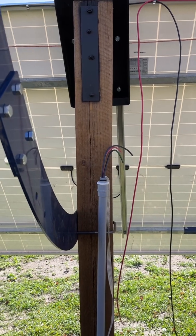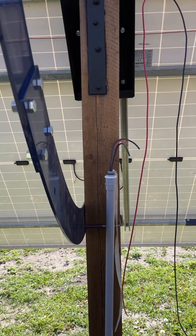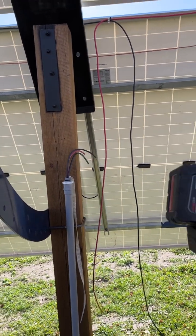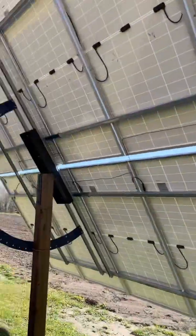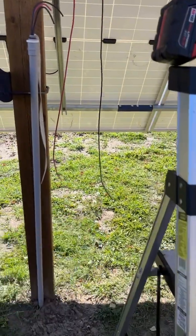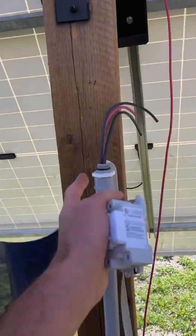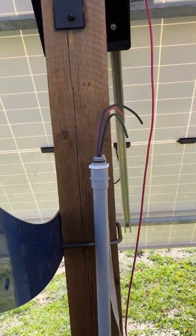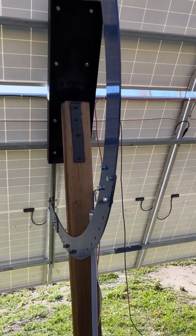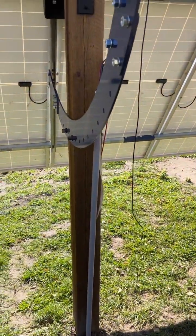I bought the IMOs not knowing, and I'm only running a six-by-six array so I didn't want a big metal box. I've chatted enough. Last one to do: positives disconnected, negative extension wires disconnected — no current coming in. I'm still going to check both wires because it's the right thing to do. These run back to the charge controller where everything is disconnected. I hope that helps some of you folks looking at this type of wiring or these switches specifically.